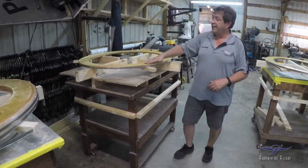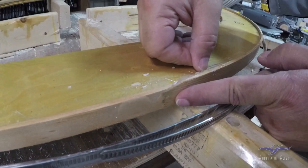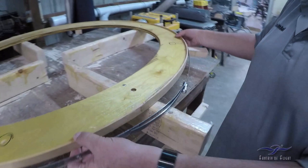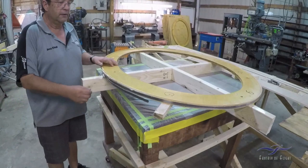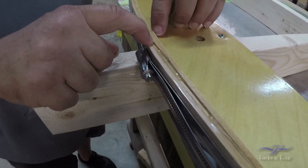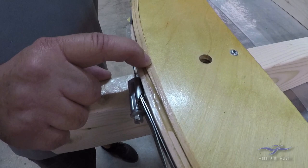Here's number nine and a half. I mentioned there are 15 stations but we have a half station at nine, and this is the tooling for that. This one has its first layer on — you can see the scarf joint right here, tapering off behind and in front, coming right together to make a closed loop. Next layer the joint will be on the other side to alternate them. Here's number nine, which is just ahead — a little bit larger. Eight will be bigger, then seven, six, five — five is the largest, that's the peak. This one has two laps; you can see the scarf joint on this side on the second layer, and the first layer's joint is on the other side.